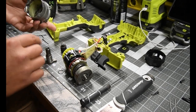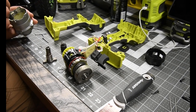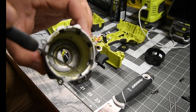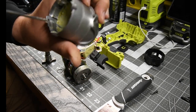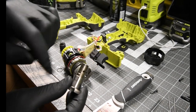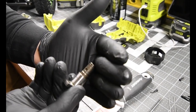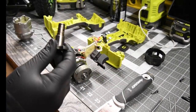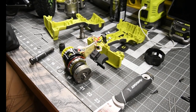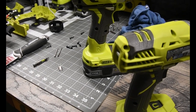Lift this up — that fell off. There is a ring inside, so we have to make sure. There are two ball bearings in there — one right there and one right here. The two ball bearings go in right there, one on each side. So while we put this into the other one, we have to make sure we put those ball bearings back. That anvil is out, so we're going to move on to this one now. Remember, don't mix up the parts.